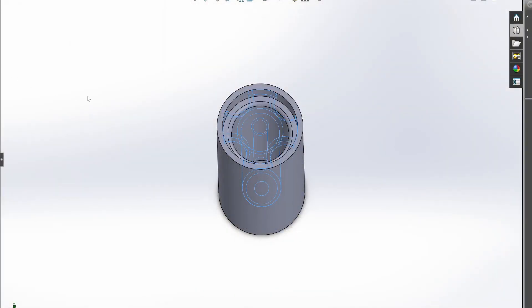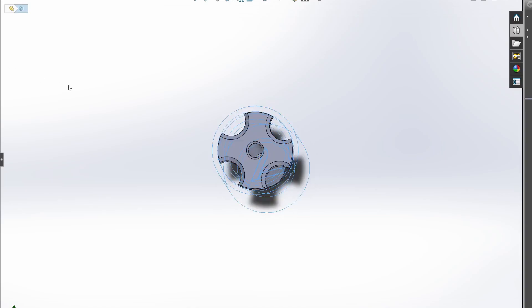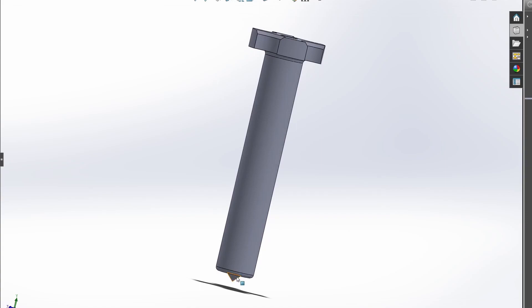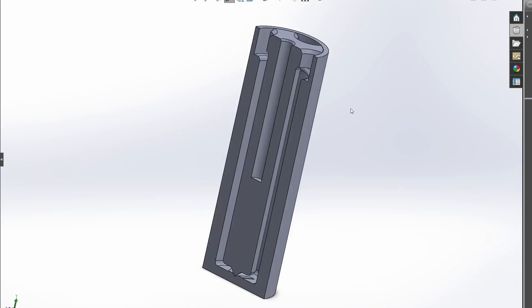I'm using SOLIDWORKS this time. There are just two parts: the cup — the outer mold which will house everything — and the core, which has some cutouts for pouring the resin as well as a center bore for a threaded rod. And finally there's a spike at the bottom which locates the core in the outer cup to make sure we get nice even thickness all the way down.